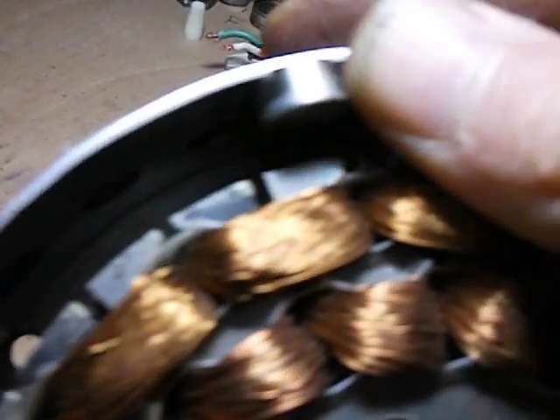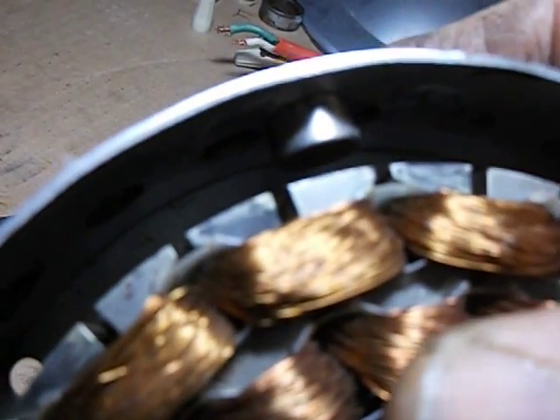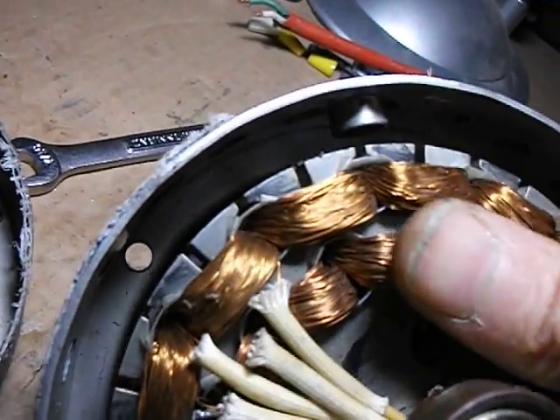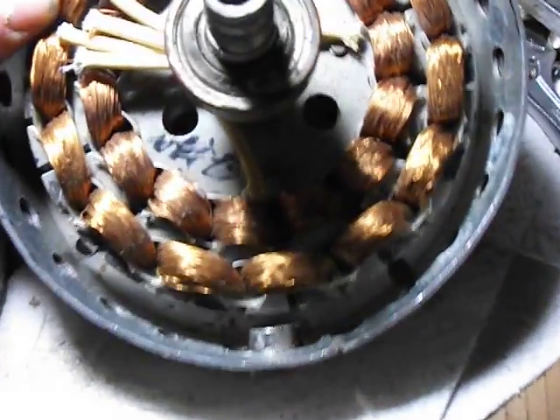In other words, you want your magnets to be even with the stator — like that. And you can see how tight I got this piece of steel in here; it's really pretty tight and it's not going to be able to pop out. With the magnet here, the magnet's going to pull this metal off this thin edge on the outside and make it stick onto the stator, because the stator spins around the magnet. So that's why I used this thickness.